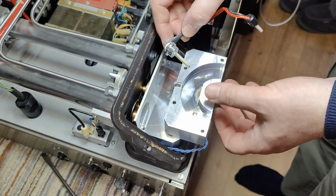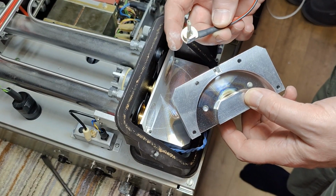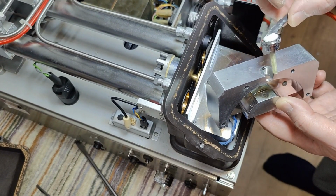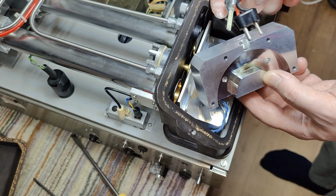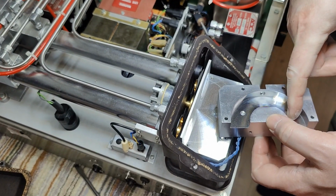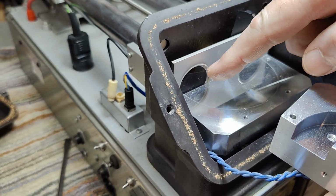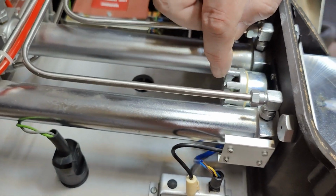So in here, that one, I thought it was a sensor, but I think this one is the emitter. This is probably infrared, because you can see the burning mark down here. So this one was probably mounted like that, right? And so this one goes red glowing hot, and so it emits infrared to each of the two sensors here. See, that's a glass, so it's not the heat, but it's the infrared rays that go through here, and then they are opened and closed in the two different ways.